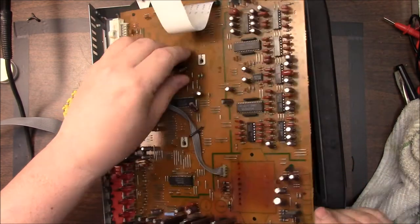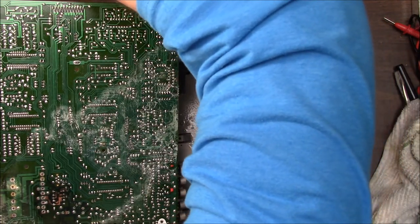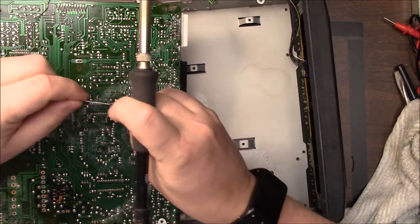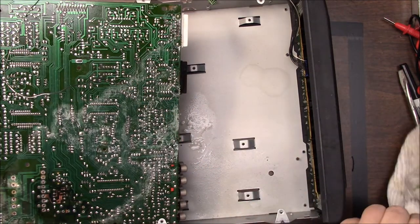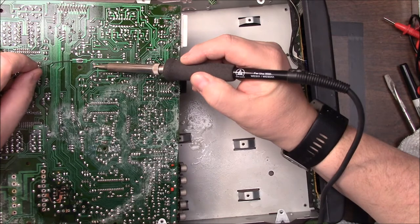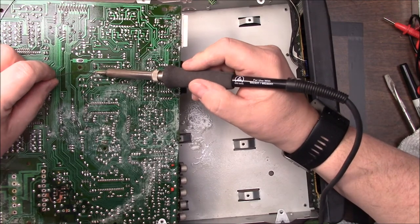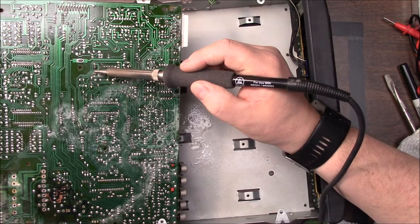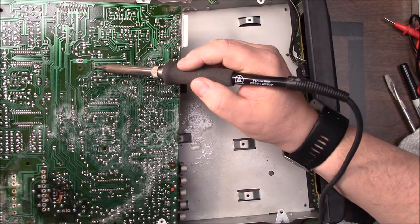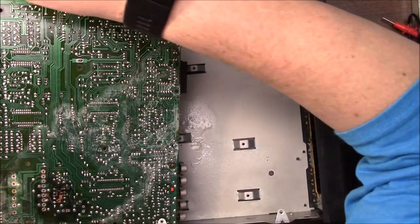There's a little bit of leakage up in here, so let's take a look at what it looks like behind here. It does look like it needs a little touch-up. Looking at it now, I think somebody has spilled something in it — I don't think it's a capacitor issue. Let's go ahead and touch up this little solder joint here. This section here looks like it got a little bit of juice on it. I'm just refreshing the solder — I may end up pulling the solder joint and refreshing it. Looks like we've got a hole there, so I may have to desolder whatever this is in here.